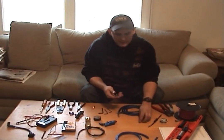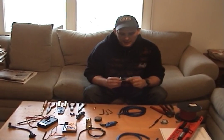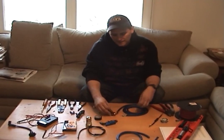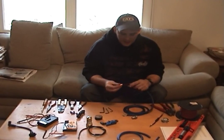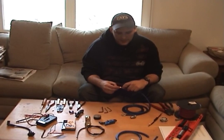I have two special connectors. This is going to be for a battery post connection, and this section here is for the wire itself to stick in. I'm going to use a 5-4 and a 3 Allen wrench to do that. Once I have it complete on the wire end, I'm going to take this copper and throw it through, and then I'm going to solder it. I'm going to get a really good connection because I don't want a lot of resistance on this.